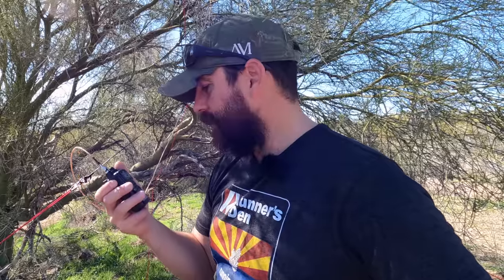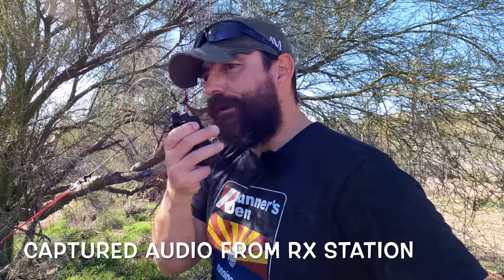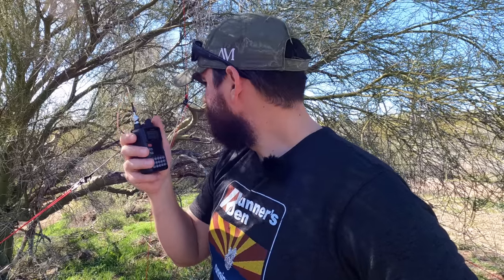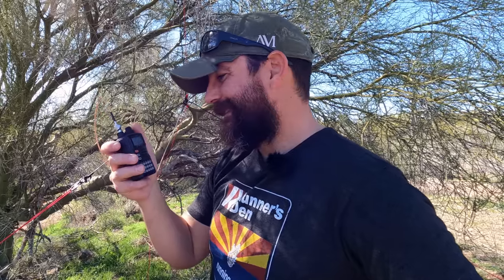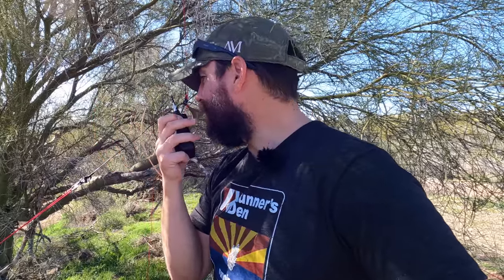So guys, there you have it. I wasn't expecting to find anybody on the air. We'll see what the audio came back. I think you guys were doubling up. Leonard, I think our searcher called. This is Gaston, I'm testing a field antenna. I could sort of understand you that time — I had to turn my radio up a little so I didn't get everything you said, but you're certainly more above the noise now. AC-70W, thanks for coming back to me. I'm testing out a quarter-wave ground plane out here in the Tonto that I hand-built just to see if I could improvise something in the field. The rubber duck wasn't doing it, but this ground plane antenna is doing the trick.